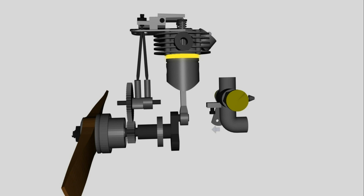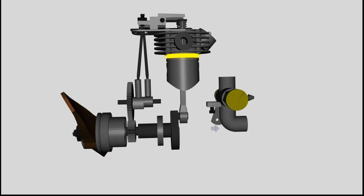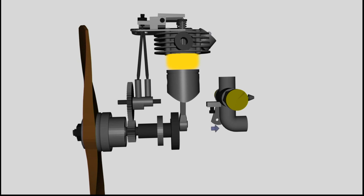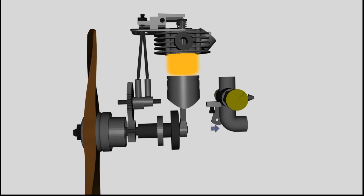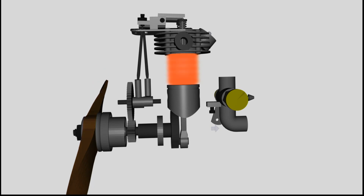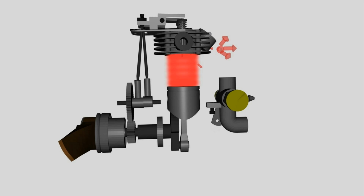The pressure of hot gas is significantly higher than those of cold gas, and so the forces acting on the walls of the containment are higher. Hence, the piston is driven back to the bottom dead center by a higher force than required to compress the fuel-air mixture during stroke number 2.